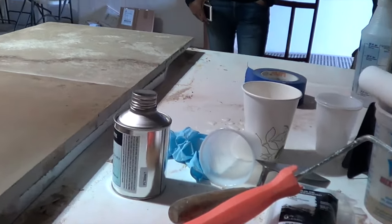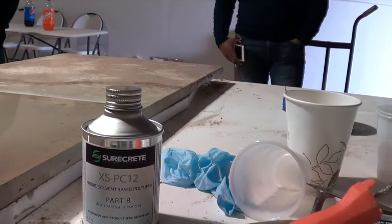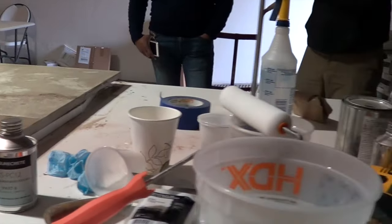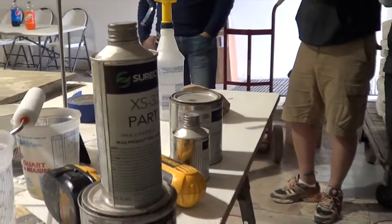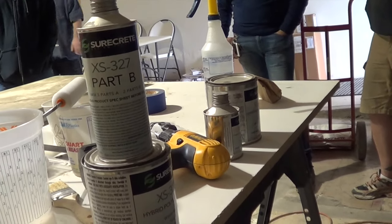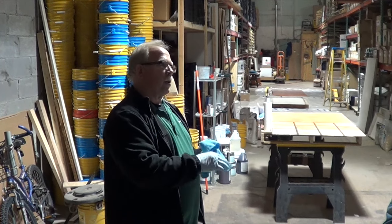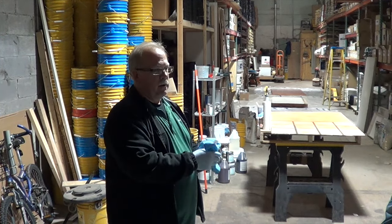If you start sanding by hand and you start going in a straight line, what we're used to by following the grain, you know, with us, if we don't follow the grain, you're going to see every sand mark. Well, in this, you start introducing straight marks, and it starts to draw. But don't go below that. If you go below that, you're going to put marks in it. You're going to see them bad.